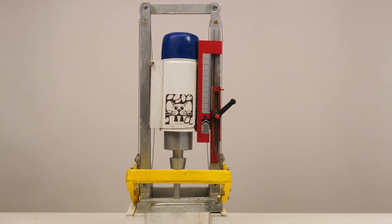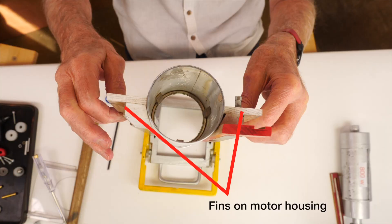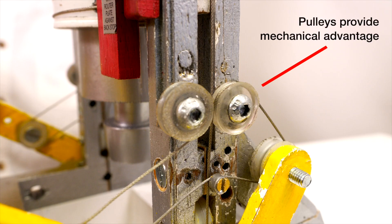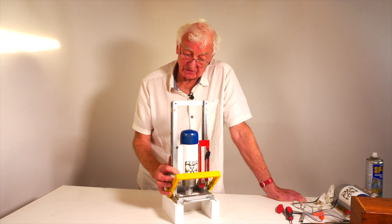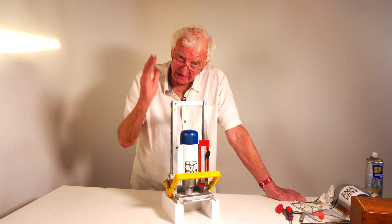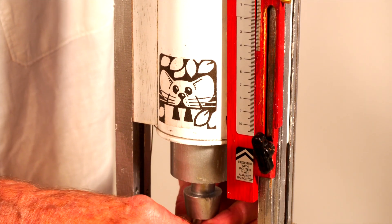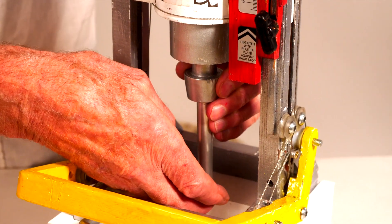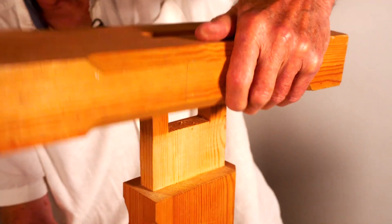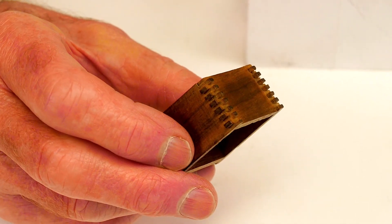Let's outline some of our innovations. We've turned this router into a router mortiser and gained fingertip control of the x-axis, y-axis, and the z. No springs means no limitation on the upward travel of the motor in the gantry — we're able to put almost a 100 millimeter bit in there, double the usual offering, and it means working from either face. We can work eight-inch timber without compromising smaller work such as a sixteenth of an inch finger joints in a ring box.